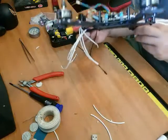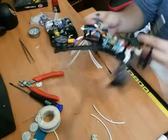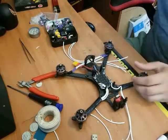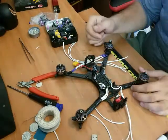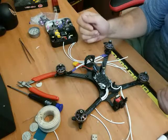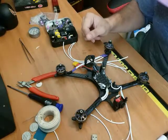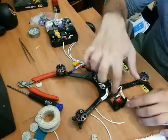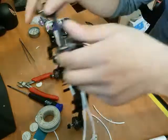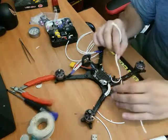Oh yeah, so I don't know if you guys can see the space between my flight controller and my ESC. Lots of room. This is a great frame, so easy to build on, I've found so far. All right, we'll pop that guy over there. I didn't have to put the frame together itself, but that's okay. The MacDAC, look him up, he's got the whole instructions for that, but the wiring is easy, and there's a place for a 2020 in the front and a 2020 in the back and a 3030, and I believe there's mounts for a 2020 in the middle too, so you can use whatever flight control you want on there.